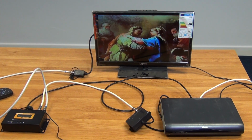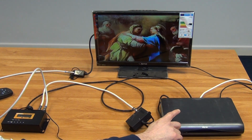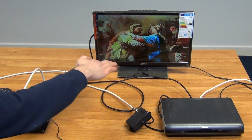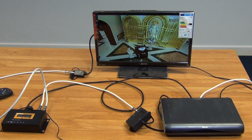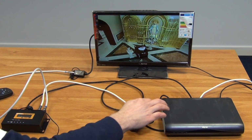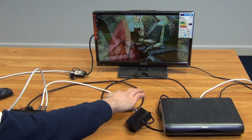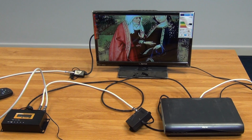So think about what we've achieved here. We've now actually two cables coming from this set-top box. The first one is the HDMI lead that takes the high definition picture, which the modulator converts over to a DVB-T signal. And we also have an I/O link signal that's turned into an RF output here by the I/O link, and it runs in here as an analog control signal.